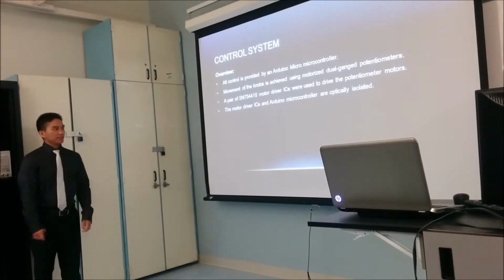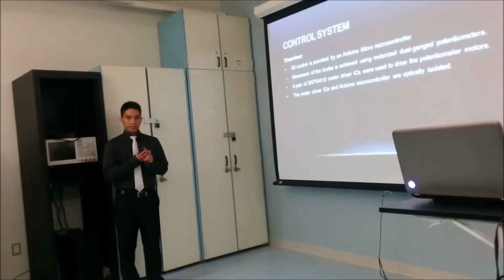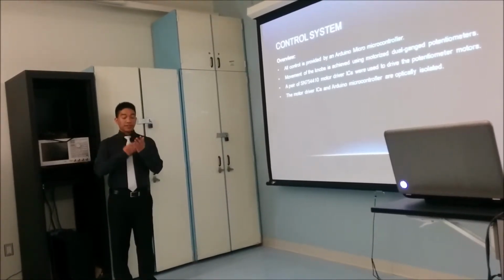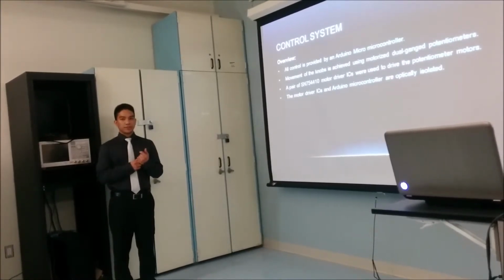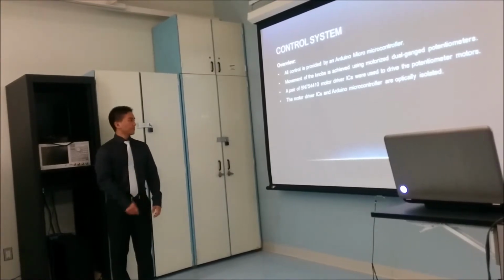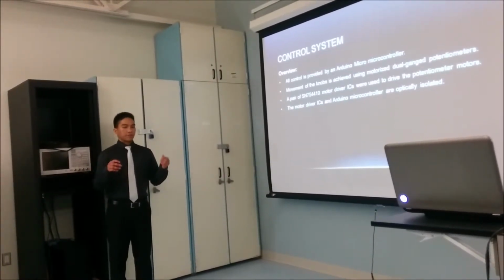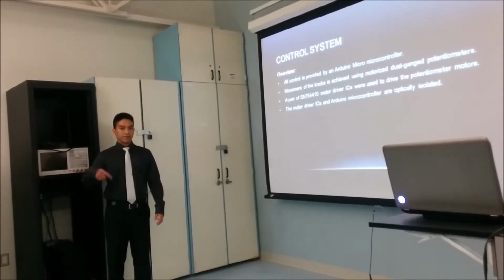The chip also has two H-bridge circuits, and that is used for direction control, which are all tied together and driven by 2 outputs of the Arduino to minimize the Arduino pins used. And we isolate the Arduino from the motor circuitry by using a 4N25, and this is to protect the Arduino from any induced current from the motor.